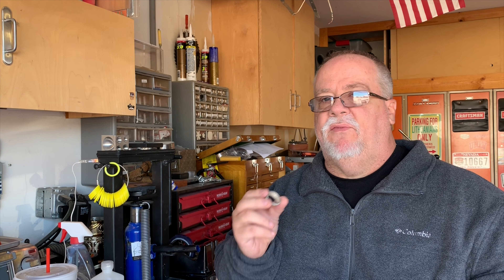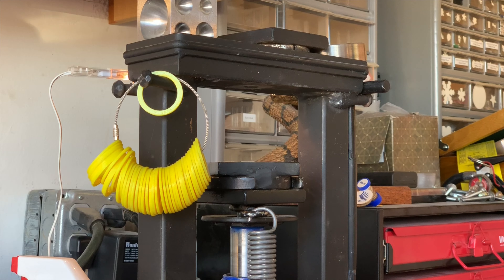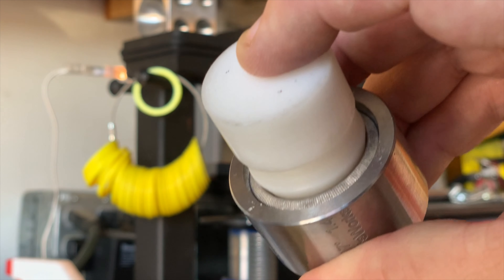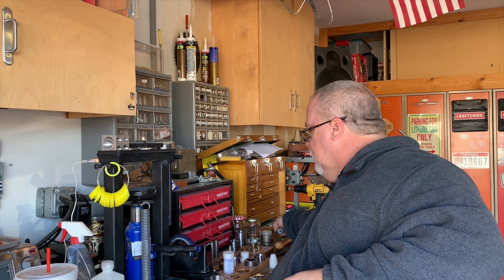I've made my ring and I'm at the end of my folding process. How do I know when I'm done folding? I'm done folding when the coin walls are touching the walls of the pusher. I am officially done with the folding process. Right now I'm just shy of 12 and a quarter, and I have decisions to make. I'm going for an eleven and a half.